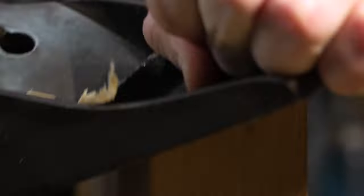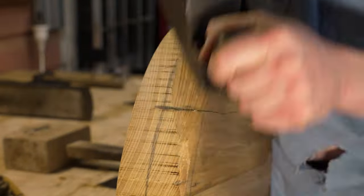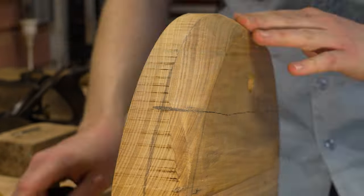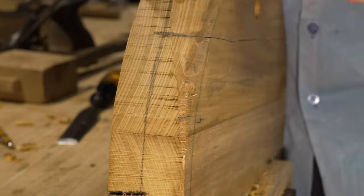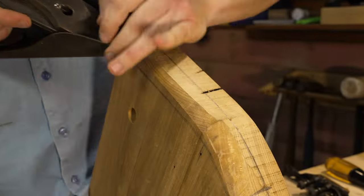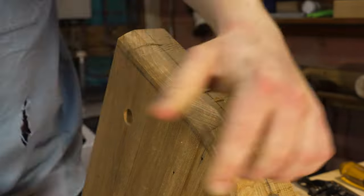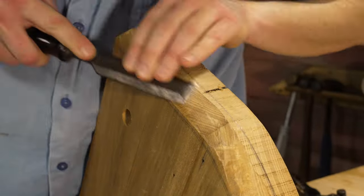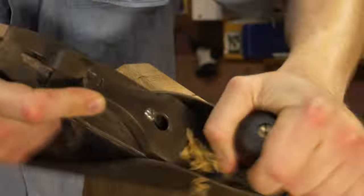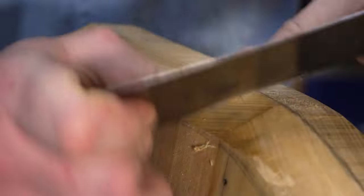It's not too bad to put on a good album and just go to town — it's quite enjoyable. A lot of the shaping of this stool, especially this back perimeter level, was running across end grain, which was a little bit tricky, but you just had to keep your wits about you. That seat is obviously two bits of timber glued together so you just have to keep track of which way the grain is going. But it's not the end of the world — you get it wrong and it's pretty obvious straight away, so just go the other way. Lots and lots of card scraping on this one.